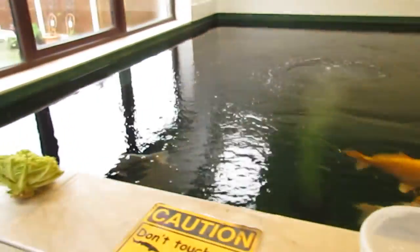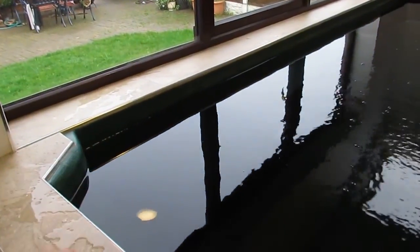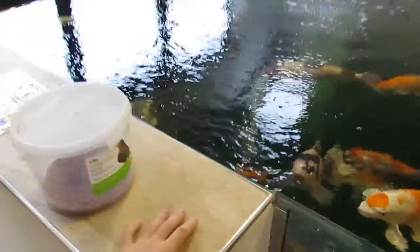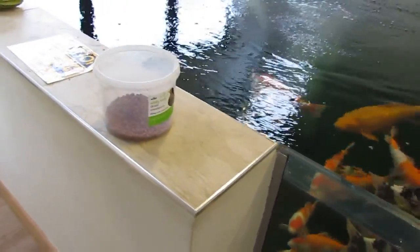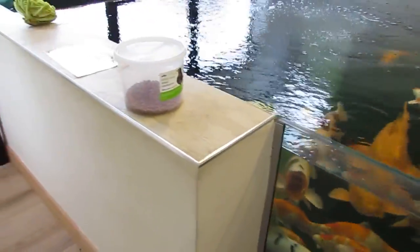But the insulation only goes down to the floor level outside, so below the floor level outside is 7.2 Newton concrete blocks, which is what this is all the way up, because this is inside, and this is unsupported, so it needed to be that bit stronger.